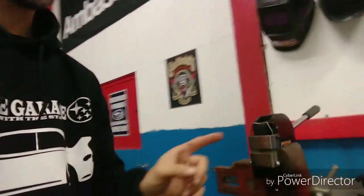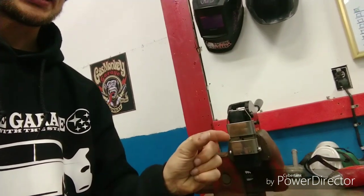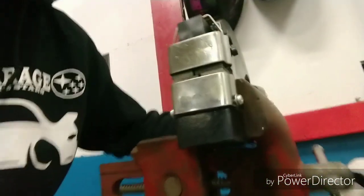In order to do so, you take the teeth on the shrinker, and they grab the panel and pull it together, almost like a Pepsi can, but they're micro crushes, little bevels and little wrinkles. And you can bring it right over to the wheel. I can work that out nice and smooth, or take a flap disc to it and clean it up. I can give you an idea of how it works.